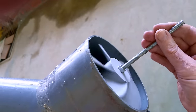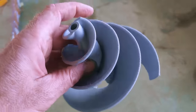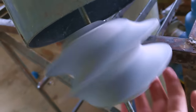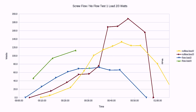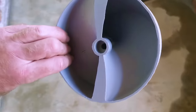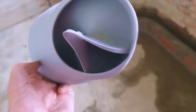The larger fan type was surprisingly not as good. The more fancy types — the logarithmic flower, the logarithmic shell, and the spindle type — all did not very good jobs at all, so they can be pretty much discarded as options. With the screw type, that's not optimized — it's basically something I whacked together in my CAD package, so it can hopefully be honed in on for more power still, just with the length of the screw, number of turns, pitch angle, and all that. There's a bunch of other graphs and data in the spreadsheet, which I've linked below. Meanwhile, the other main takeaway is that the flow guide actually made things worse, which I'm slightly but not completely surprised by. I will experiment with other kinds of stator and flow guide designs to see if more efficiency can be gained from spinning the water onto the runner, but that's also going to be better suited for an in-field constant-flow situation.